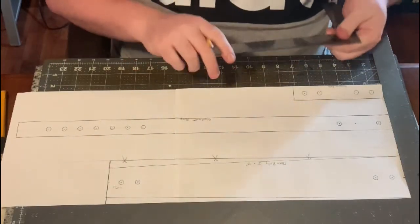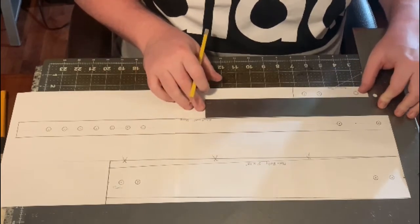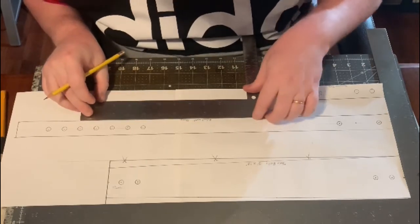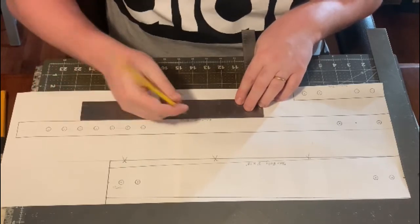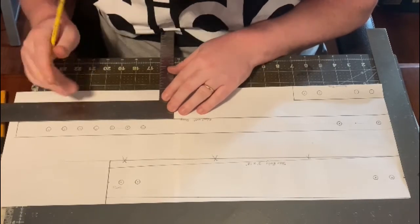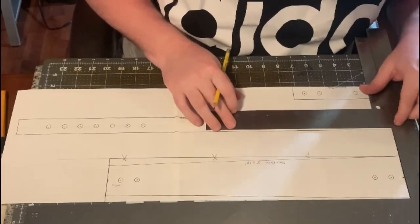So again, just take your square. I lined it up, and then come in, draw my line out, and then, of course, this isn't long enough. This is only 1 foot long. So I'd come out, and I leave myself quite a bit of room here, and I use that to line up my square for the next part of the line. Because if you've got quite a lot of line here, if this is lined up for 3 or 4 inches, you can guarantee the rest over here is going to be straight. So then you just mark it out, use that line, move it on down, make sure you're lined up with the line you previously made, and then mark it on out until you get to your 24 inches. Exactly the same thing for the top. I come up to a 1 inch space.